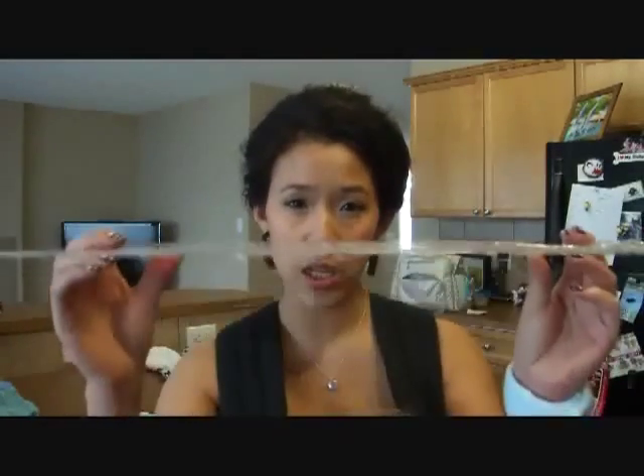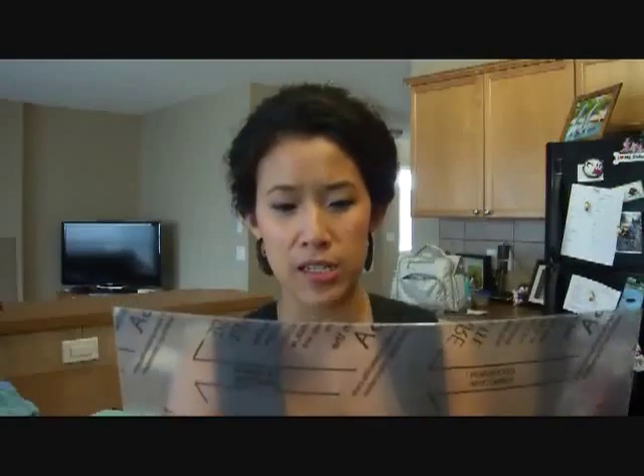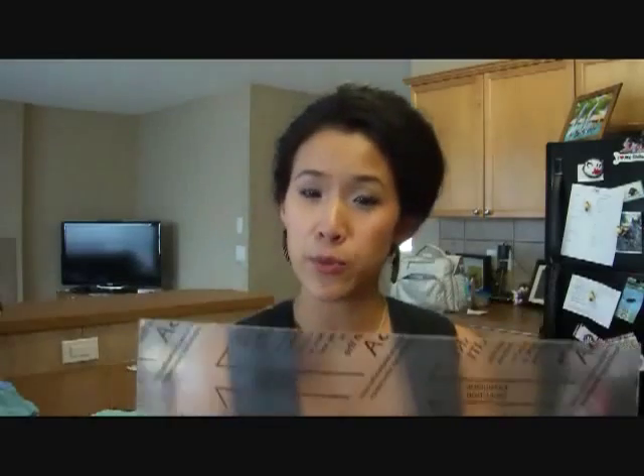There are a few things that you're going to need. I went to my Home Depot and I bought this Plexiglas — it's an 11 by 14 sheet, a sixteenth of an inch thick, or 0.08 inches according to their measurements. It's extremely flexible and it's actually the Plexiglas you can buy to use instead of glass in a picture frame, at $5.88 for the whole piece. I needed about a piece and a half to finish my cutlery drawer. In retrospect, I would probably go back and buy the larger sheet of 0.09 inch Plexiglas because it is much thicker.